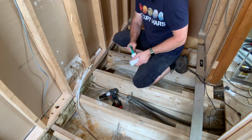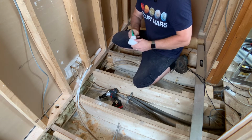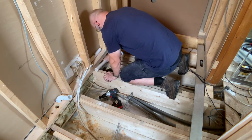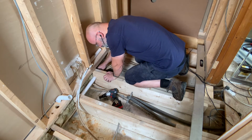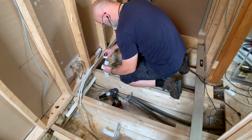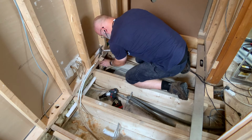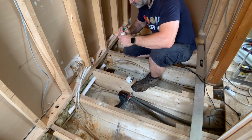Before welding PVC pipes with solvent weld, it's best to score them a little with fine or medium grit sandpaper. The rough surface helps the material bond better. Once the solvent weld is applied and the pipes joined together, there are only moments for corrections before the PVC is irreversibly bonded, so it really pays to have all measurements correct before this point.